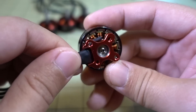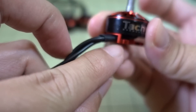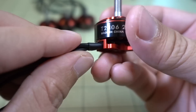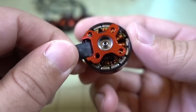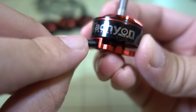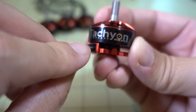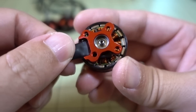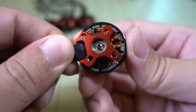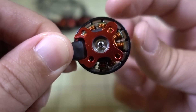The open bottom is kind of a trend every motor is doing now. This one has a little collar here that prevents the motor wire from rubbing against the bell — some people think that's a good thing, some don't. Motors like the HDL RC have it, the Emax does not. On the bottom you have a set screw instead of a C-clip, which is a good thing.